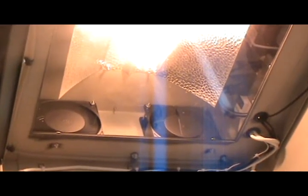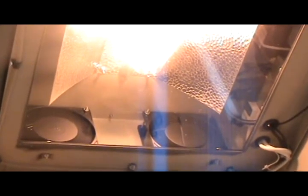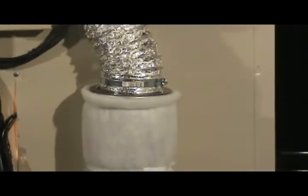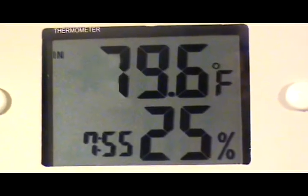We have very powerful intake and exhaust fans in the flowering chamber and up in the light boxes, keeping plenty of fresh air moving in and out over your bulbs to keep your system well ventilated, along with this blower which is pulling out high volumes of hot air, passing it through the carbon scrubber for no grow odor and keeping you under 80 degrees.